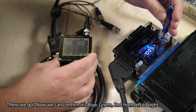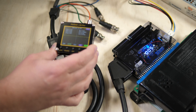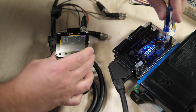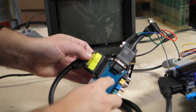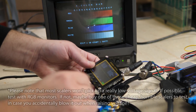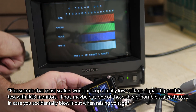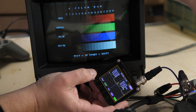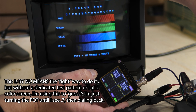This one uses potentiometers for each line, but others might use a dial or multiple dials. Regardless, just turn it until you see the voltage go all the way down, then bump all three colors up just a hair so you see a signal on the screen. Now you could finally connect your display. If you're using the RG Bench, you'll want to turn the 75 ohm termination off and connect the output to the display. If you're using probes, just remove the resistor and probe the signals directly. Your display or scaler is now providing the termination, but you could still tap the video signals somewhere. This is the other killer feature of using the RG Bench — no need to tap around a SCART head; the RG Bench just passes them through.